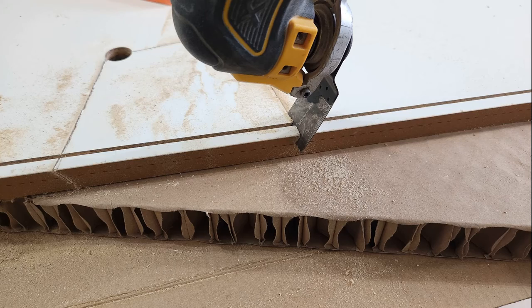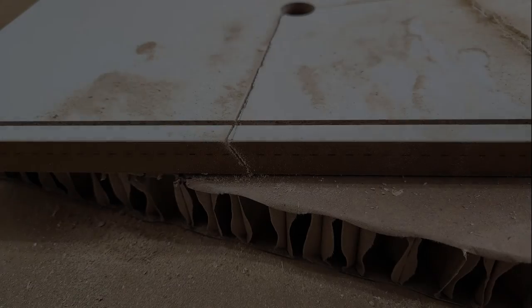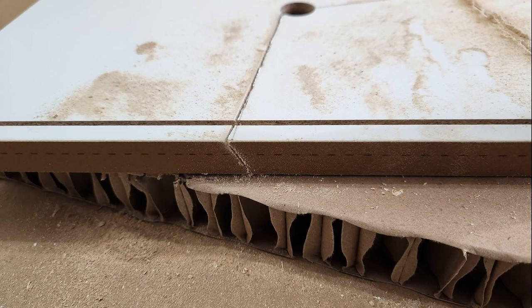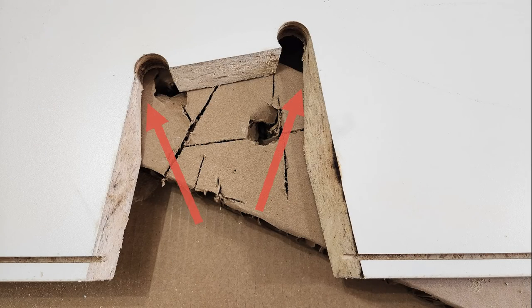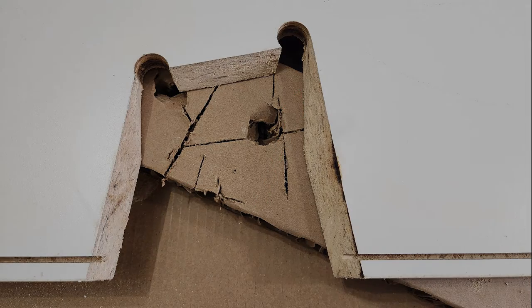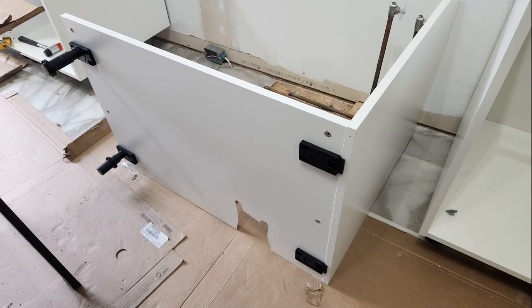You're leaning it, and you can lean it quite a bit downwards. You want to make sure that you are cutting into the hole and not away from the hole, because the whole idea is that you get a ledge on which you can rest that piece that you're cutting out. As you'll see, I have cut at approximately 45 degrees and now I can take out that piece and cut away in front of the holes — otherwise I will never be able to get those pipes in there. Now I'm ready to assemble the cabinet around the pipes.